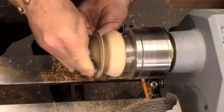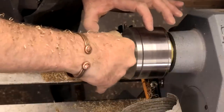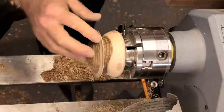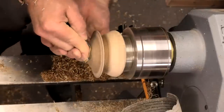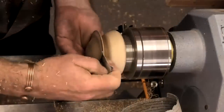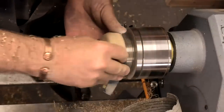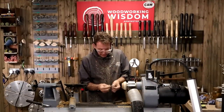Sand down free — let's radius that edge. Gently taking the sharp corner off, blending it into both sides. Not trying to hit too much of what was already sanded on the underside. So 150 — hopefully pretty good. Fingertips — 240 now. Radius that corner, I can even bend the paper. 150, 240 — let's do that inside. I'm going to make sure we fold it again — three layers makes it stiffer, easier to control. Looking down — the center point is the tricky bit to get out to the corner.